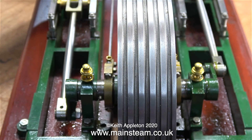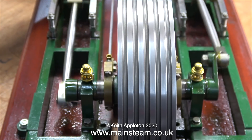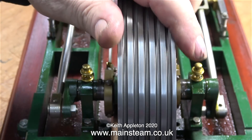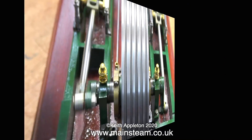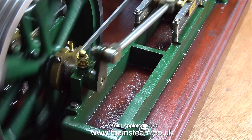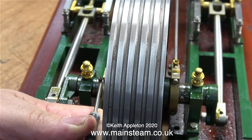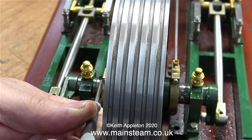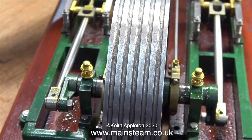Once I've tapped it round a very small amount with the hammer and tightened the grub screw, when you get to this stage you have to put some low pressure into the engine and grab the flywheel - then you can see the point at which the air is admitted to the cylinder. The compressed air or steam needs to enter the cylinder alternately at both ends of the stroke in exactly the same place. To illustrate this, I'm moving the eccentric a fair way - the high point of the eccentric is now just past 90 degrees to the crank web.